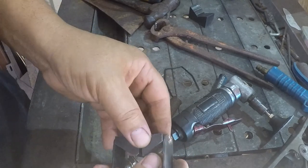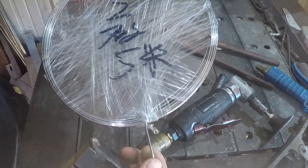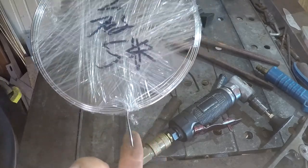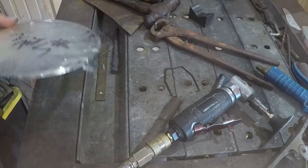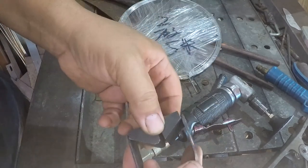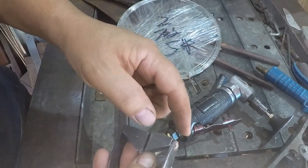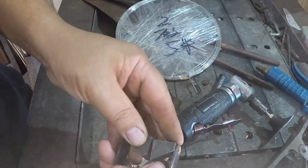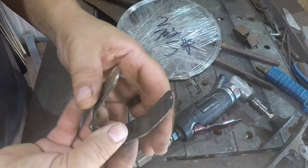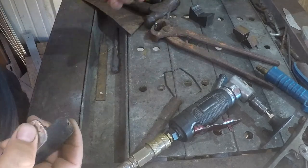So I'm just going to go ahead and snip off this little end sticky outy piece and braze that in there, because I know this isn't going to cause a problem and I don't want to cut up another one of those drill bits just for a little tiny piece, since, like I said, the locating is being done pretty well with the just flat sides of this little carrier that I've built. That should work, he says, doing the exact same thing for the third time.